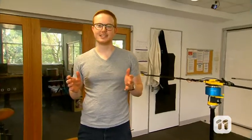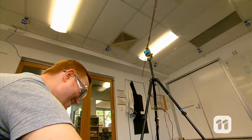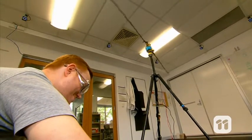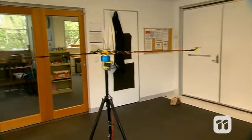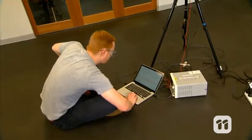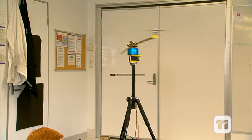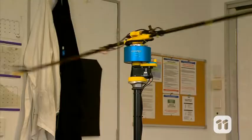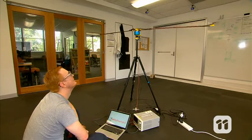But before I fitted the sensors, I needed to test them through the air. So I asked the question: how do you make a sensor fly without flying? By using this. It's called a swing arm test. The sensor and rotor are fitted to one end of this arm. When it spins around, the rushing air affects the rotor, just like it would if it was flying through the air. And by swinging the arm at different speeds, we can tell our sensor is detecting the blade flapping, picking up the changing conditions.